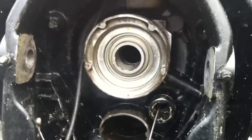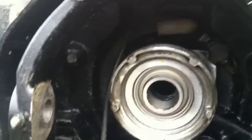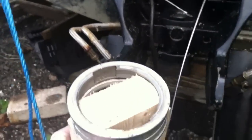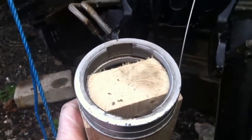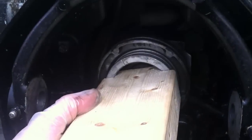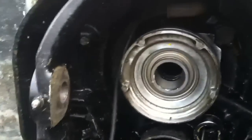This is Alpha 1 Gen 2 and I'm covering the bellows install. Here we are with the new gimbal bearing in. I've just checked the alignment and it's all okay. I have a tool I use to put the bearing in - it's the outer race from the old bearing. I cut the gimbal part out from inside, then cut some shoulders out of a bit of timber and used that to knock it in. Couldn't get hold of the proper tool but that's done the job really well. That's all in, ready to go.